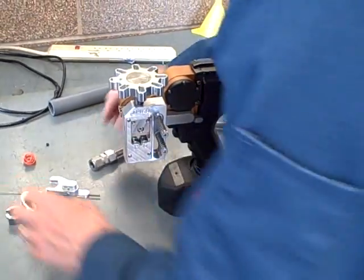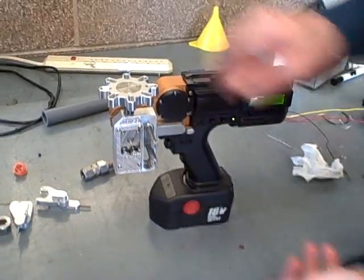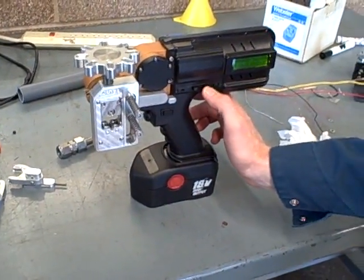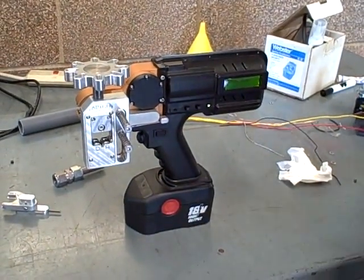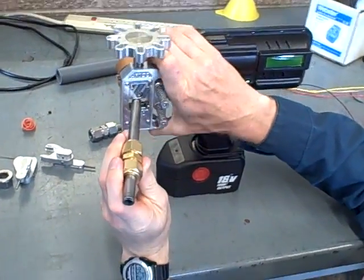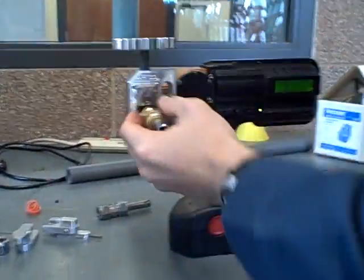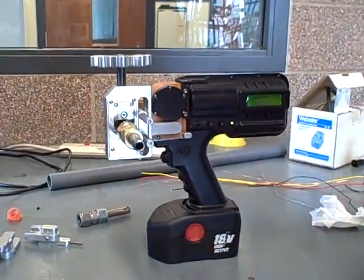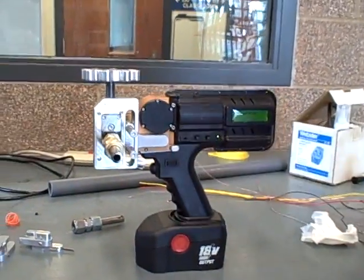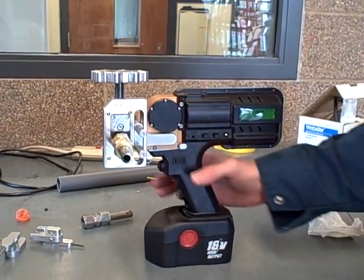When we're cutting tube, we have no need for a one-and-a-quarter turn requirement — we just turn and turn until things cut through. So what I'm going to do is set the tool in a different mode. Hold this button down for a couple seconds and it goes into cutter mode. So now I take my tube, set it in place — there we go, that's where I want it to cut. Bring that down gently like that. Now when I touch the trigger, it's just going to keep on turning at full torque, turning and turning and turning until I touch the trigger again, and it will be done.